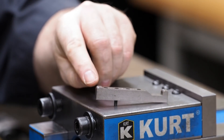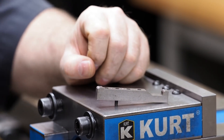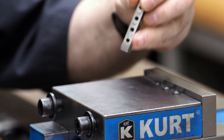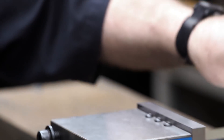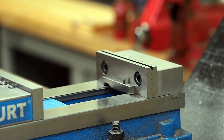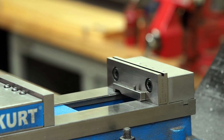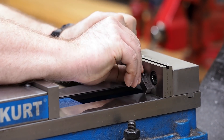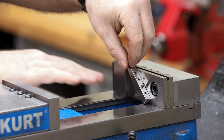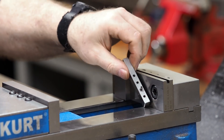Some of the issues you may have with this: if you start wearing this down, you've got to re-grind both those surfaces and hit that three-inch dimension right on the money again. But the bigger problem is when you're using it in the vise — you've got this great big old gap in the middle, and if I want to use a larger angle, I'm about bridging that gap and there's not a whole lot of room.